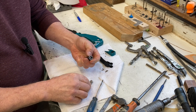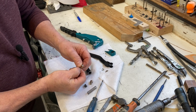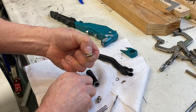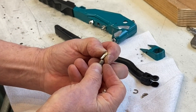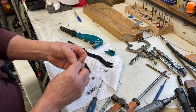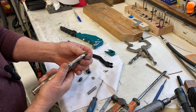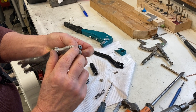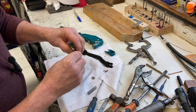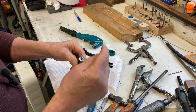The only thing this part is for is retaining a spring that helps work the jaws — the jaws are what grab that rivet shank. We're not going to change how that spring works, just the retainer. The most important part is this little dome here that helps spread those jaws back out — that's what lets it release. Don't modify anything on the backside. Pull that screw out, take it to your grinder, and grind it down — all you need is one good thread all the way around. Get it down as far as you possibly can, then screw it back in.